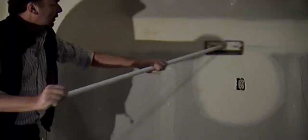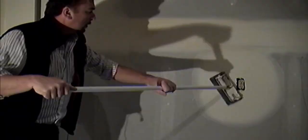When finishing drywall, there are a lot of procedures that will be duplicated for each coat. This section of the wall has been brought to its final coat of compound, three coats of the compound on the butts and flats, with the final, fourth coat consisting of a tight skim coat. The screws have had three coats of compound, but with the fourth coat consisting of a full 6-inch wide skim coat, capping off the screws. The angles have received two full coats, a sanding, then a third tight skim coat of all-purpose compound.